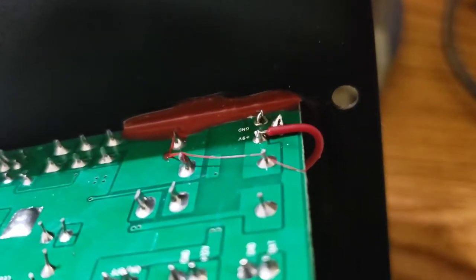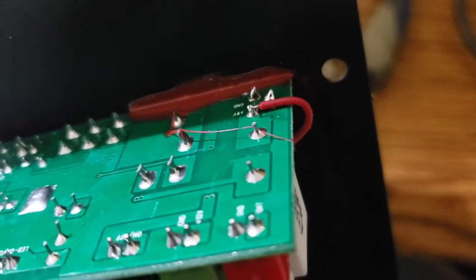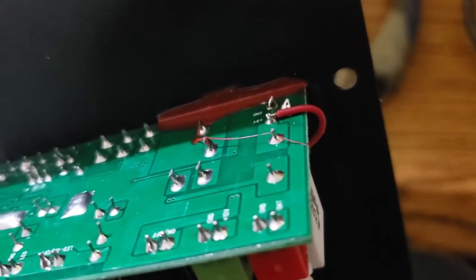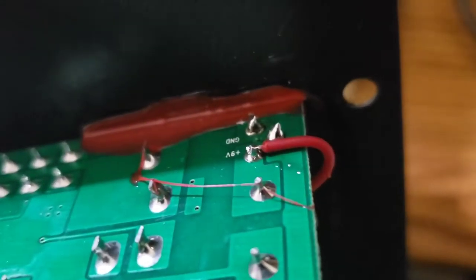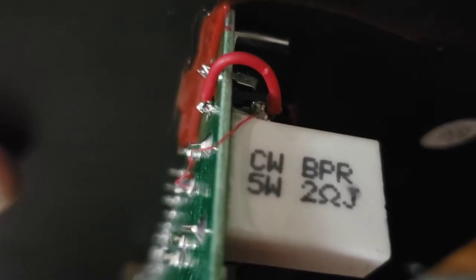It's not pretty, but because of the location where the pin soldered into the board, it literally covered itself up and I couldn't get solder above the board where the port soldered on to actually bridge it. So we had to do the next best thing and find a jumper wire, solder it to the actual post underneath, and solder it to the actual backside of the port. This should be stable enough and that's about it.